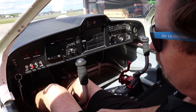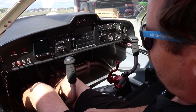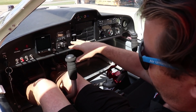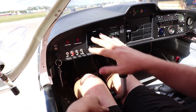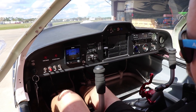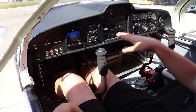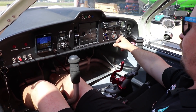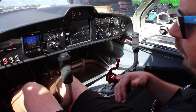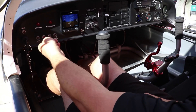Once inside the plane, there are a couple of things unique to this aircraft — it's a seaplane and a retract with a different configuration. This is a very simple aircraft to operate; the engine is fuel-injected and computer-controlled, minimalistic from a buttons and switch standpoint. We have our master here, which allows power to the panel. We'd have our iPad mounted here for redundancy alongside the Garmin G5 on the wing bug, plus the ability to record flight data. Everything turns on as expected — avionics, G5, all instruments indicating. We have our intercom and remaining switches, including the fuel pump. Both pumps turn on.